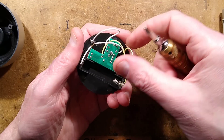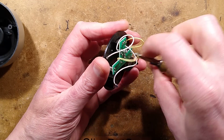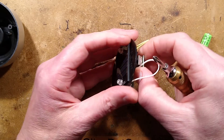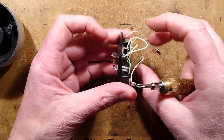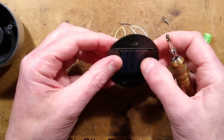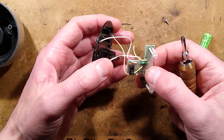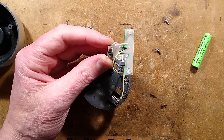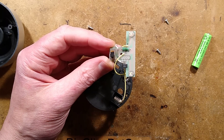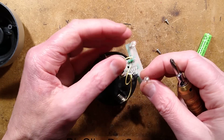Let's pop the circuit board out and see what it's got. Polycrystalline silicon tends to be a bit more generous in terms of current output for a given size — I shall test that. It's a classic four-pin chip. It's got an inductor: brown-green-brown, 150 microhenrys. So it's not going for mega brightness, but it's going for an okay brightness.